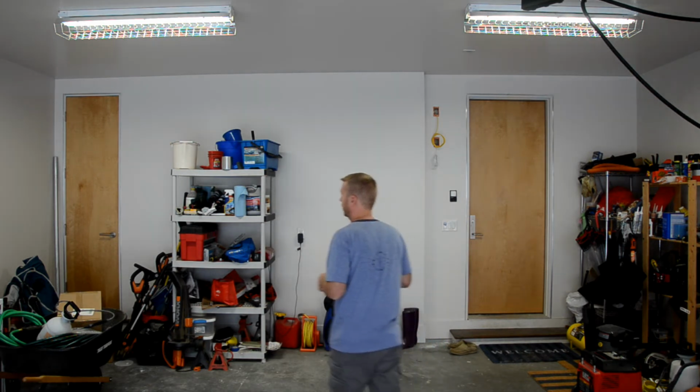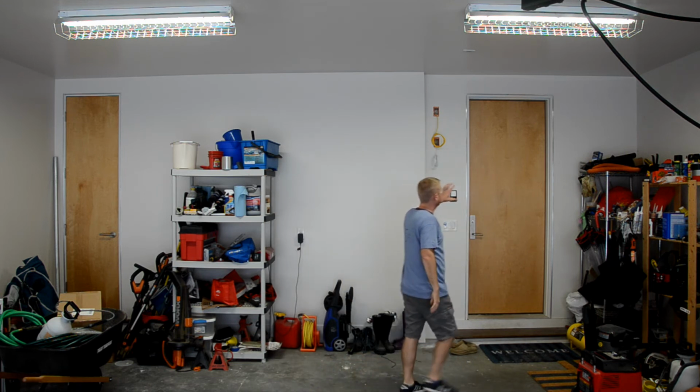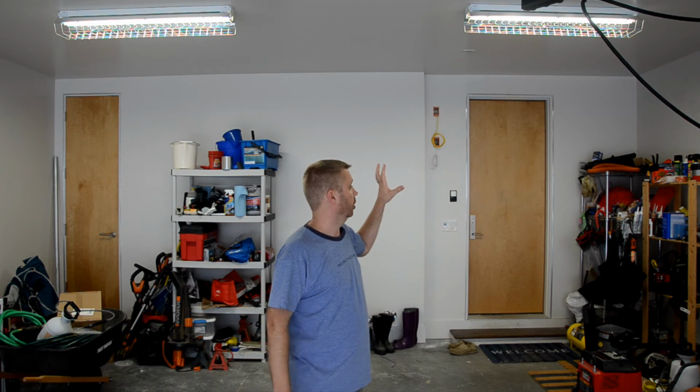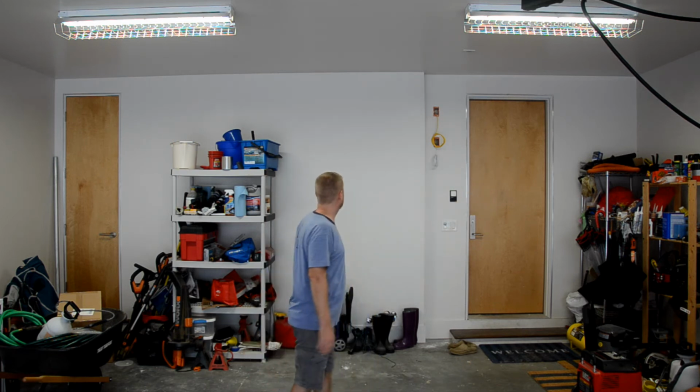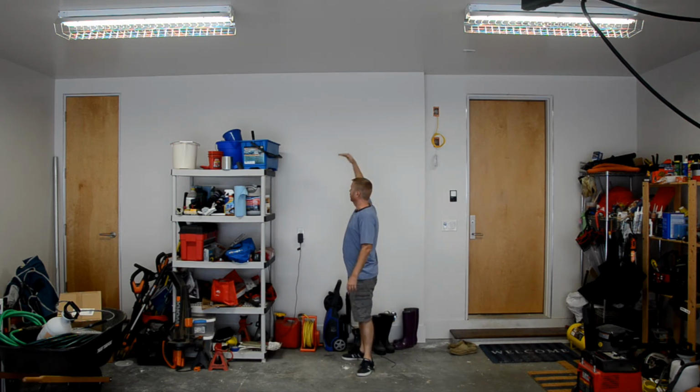So here's my plan. First step, I'm going to install the 4-foot slat walls in this corner, followed by the multi-use locker that goes here. I'm going to install the slat wall installation strips only over here. After I'm done with that, the rest of the cabinets should be arriving, and then I can install 2 multi-purpose lockers over there. Then I'm going to install the wall cabinets up here, then the wall control pegboard system here, then the base cabinets. I like to work from the top down, that way you don't have to reach over the base cabinets. Now, every step of the way, as soon as I get a cabinet installed, I'm going to go to my plan and sort through everything and put things away to free up more space as things go on.